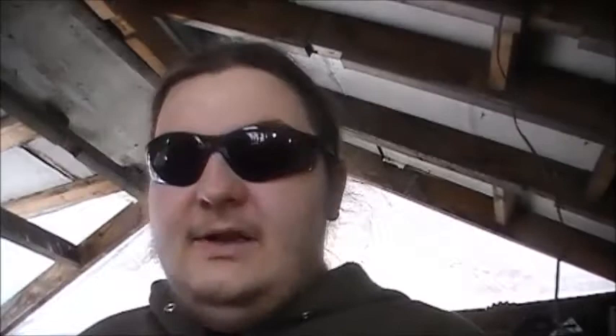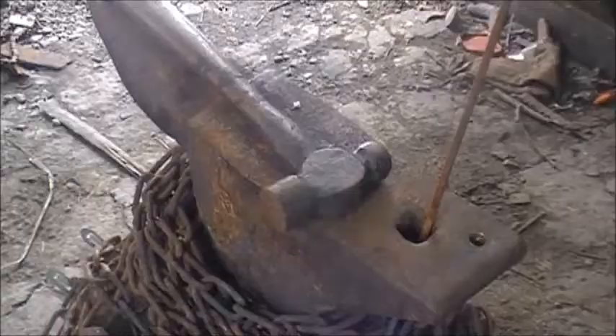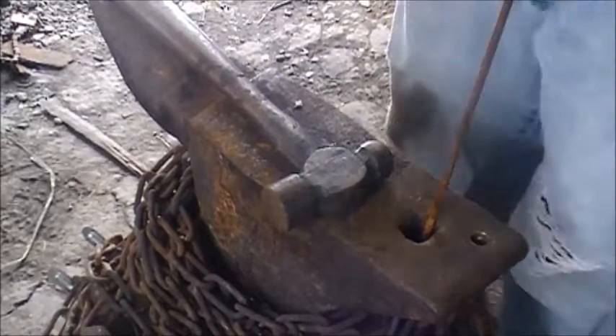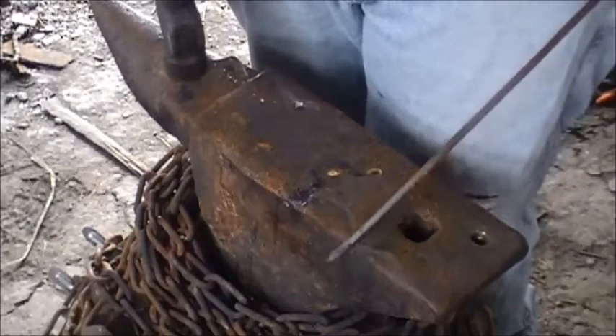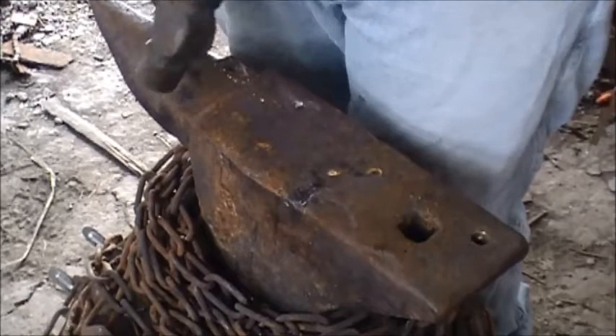This is just going to be a good exercise in tapers and possibly rounding. I'll take you guys along with me for that and we'll get started on some tapers. For this project today, you don't really need anything fancy. We're just going to take a piece of round bar, put a taper on the end for the poker, a nice little taper and then a hook for hanging on the back. The hammer we're going to be using is our ball peen hammer.